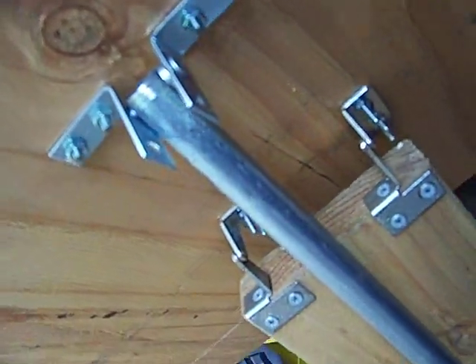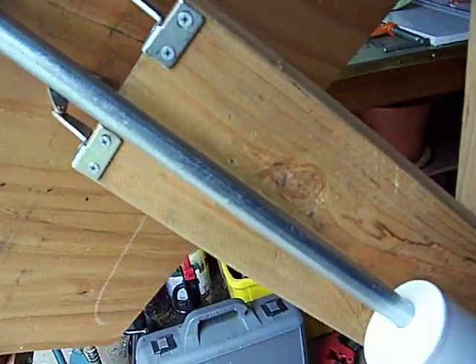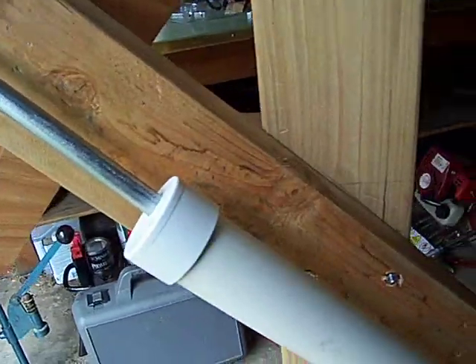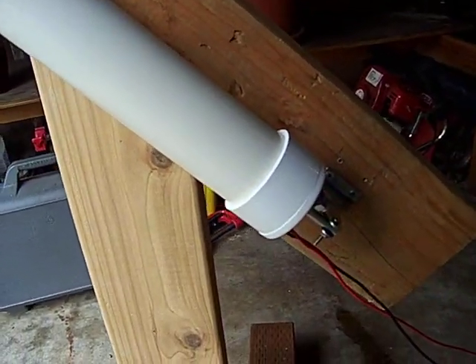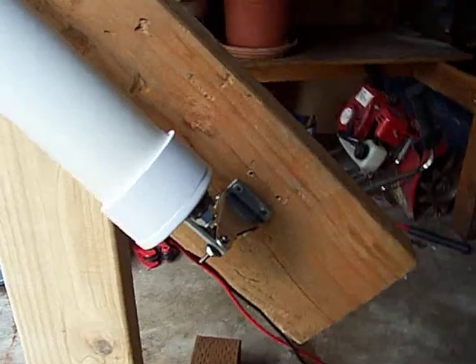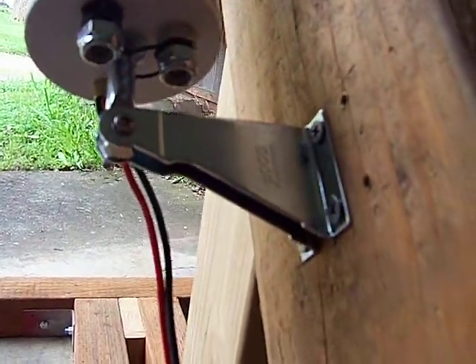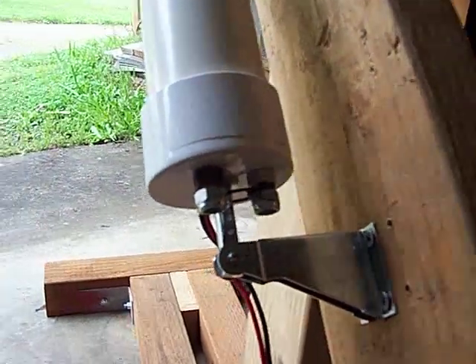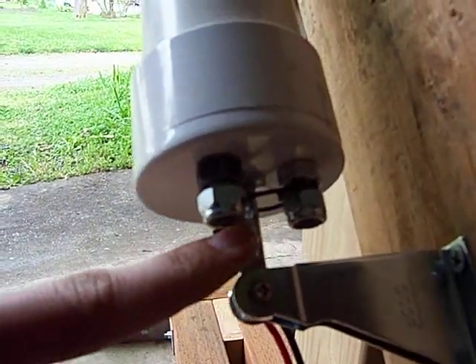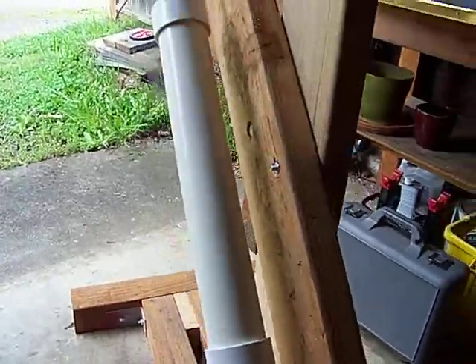You can see the bracketing here that I made for the extension of the linear actuator. It goes about 8.5 inches to pan the solar panel. I made a PVC actuator with motor mount and sensors inside. It's hinged down here with a screen door hinge, and there's a clevis pin that gets mounted up inside the end cap. The whole actuator is mounted to the end cap so I can just pull it out and work on it if I need.